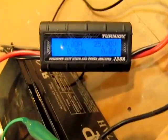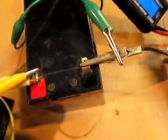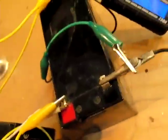So what I've done is I've doubled some of the wiring up to accommodate the higher amperage that this is going to pull. Now you don't want to wire anything like this — this is just for a test. Let me repeat that: this is for a test. This is the incorrect wiring, but especially for these because this is going to pull about 10 amps, which would fry one of these wires if you leave it on too long. So I'm just doing this for the video.